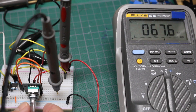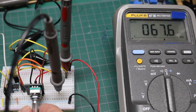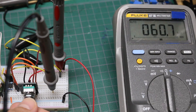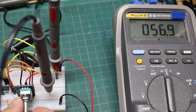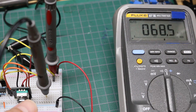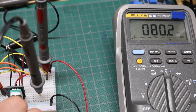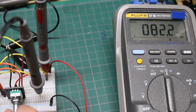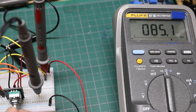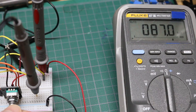In realistic terms, even with a proper application properly debouncing in software, you can't really expect it to be perfectly clean — you just know that if you tried to go hard counterclockwise you ended up somewhere low. Going one at a time gives more control. Starting from about 57k and going quickly up I went to 60, 68, 79k. Going slowly it's just 1k per click: 80, 81, 82. Trying three at an OK speed toward 85: 1, 2, 3 — went to 85. Another three: 87. And three more: went to 90.